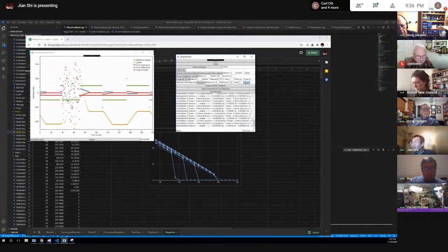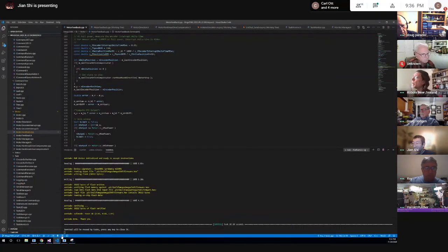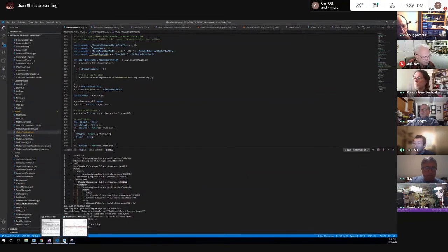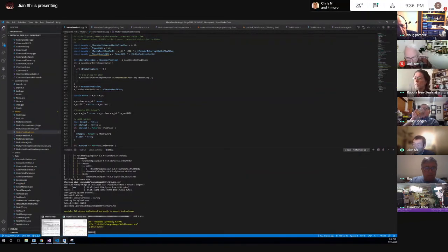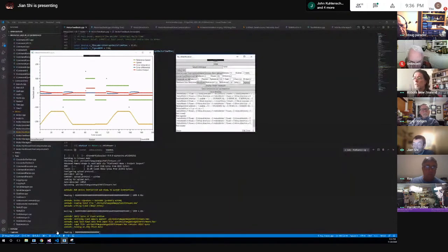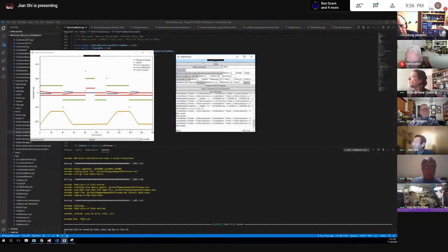Let me think. What am I doing here? I'll download this code again. I think I have an integrator there, so let me do this again, just to reset it. But yeah, I have to be careful with the gain. The approach, I'll show you guys, is working, but I don't like this. I have to know the starting voltage and this kind of motor specific information.